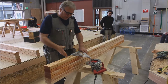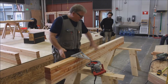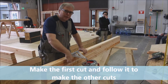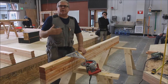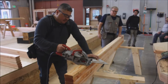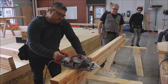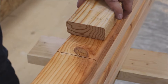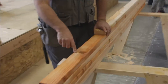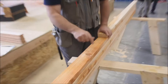What we're going to be doing is cut through one and a half of these studs. After that cut's made, the partner — or you — will take and slide this one back and then make the next cut. The cut in the second piece is basically the line you're going to follow all the way down to make your final cut. All you have to do as a carpenter is just follow the same curve that the saw blade made.